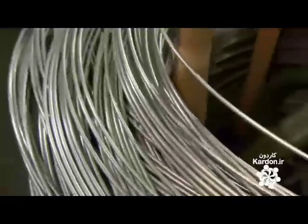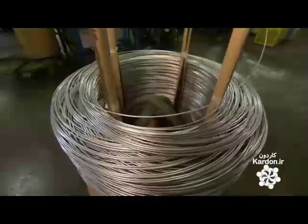It's time to stock up on rivets. They make them from round wire. A machine cuts the wire to length and then punches it into a die twice to form a rivet stem blank. Here's the cutting and forming action in slow motion. The machine operates in a blur, producing 200 rivet stem blanks a minute.